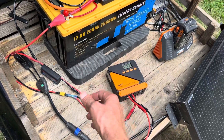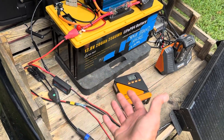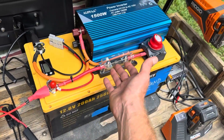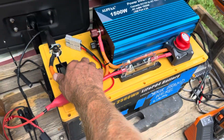I don't have any circuit protection on the charger because I'm with it all the time — it's never connected unless I'm in the vicinity of it. If you're using this indoors or in a place where you're not monitoring it, you would want to add proper circuit protection to your charging circuit. Circuit protection on the inverter is vital regardless — you always want that no matter what.